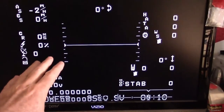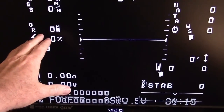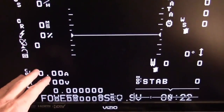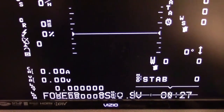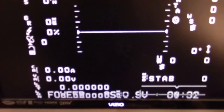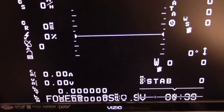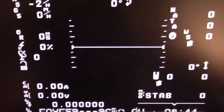The good news is it's working. If you see characters with a sort of Venetian blind effect — alternating scan lines that look really funny — chances are it's just set to the wrong video standard, either NTSC or PAL. In my case I need NTSC, but sometimes they come set to PAL. It'll look like blinds with everything stretched out. Don't worry about that because it's fixed later when you configure the MinimOSD.